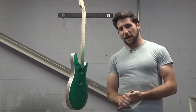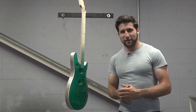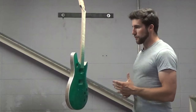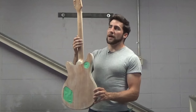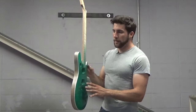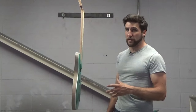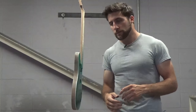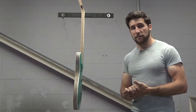I'm using black nitrocellulose lacquer with a fairly large paint gun — a 1.5mm nozzle with the fan pattern turned all the way down. In a later video we'll cover taking the black off the binding to get the binding effect back, and also how to get rid of the gloss on the back of the neck so your hand can move more easily. I'll explain more as I go, so let's get started.